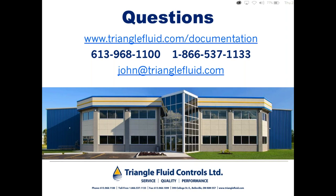So obviously you wouldn't want to use a DFT check valve in a sewage application where there are lots of rags or other bits of stuff going through. However, the DFT check valves will tolerate some entrained solids. So my recommendation to you would be, if you have an application where you're considering using a non-slam check valve on the discharge of the pump in a slurry service, to get as much detail as you can